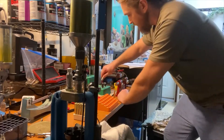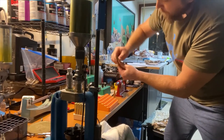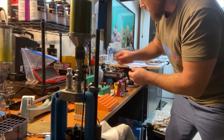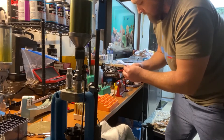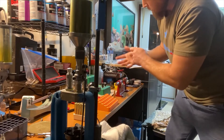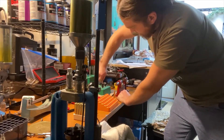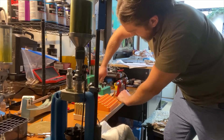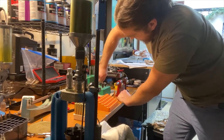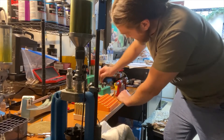The way I do it is I've got to kind of stand up and get a good grip on the brass. Make sure your hand is away from the case neck, especially if you've just deburred and chamfered it, because it's going to be a little sharp. I've got rings on my hand from digging in there. So grab it, ease it on there, and just press firmly until you know you've got that military crimp out.